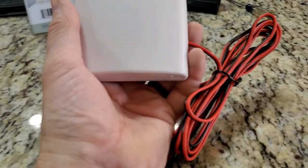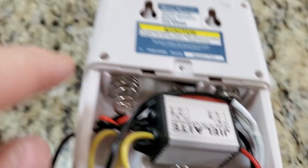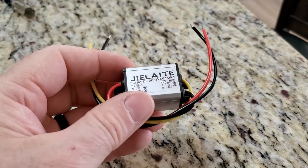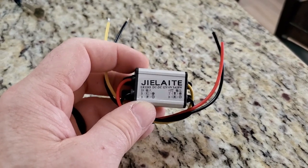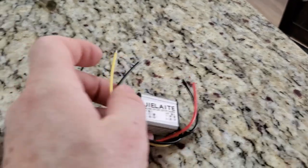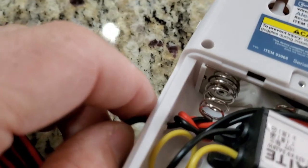Here's the actual unit. You could buy a 6 volt adapter and plug it into 110 volts AC if you have an inverter, thereby skipping this mod. But I wanted to run off 12 volts. This is where the 3 C batteries go. I got two of these units — about $11.99 for the pair, or $7.99 each on eBay or Amazon. This is what's called a 12 volt to 6 volt buck converter. You hook the black and red up to your 12 volt source, and the yellow is the positive 6 volt output. I also bought a $7.99 12 volt cable with an on/off switch so you can plug into any cigarette 12 volt outlet. I drilled a hole in the side of the box and ran the wire in.